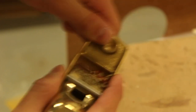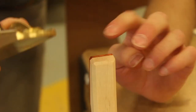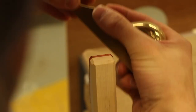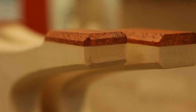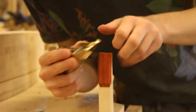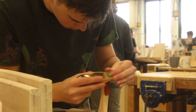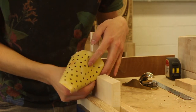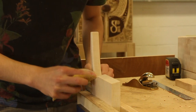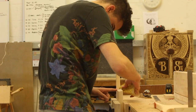In the next part, that's when I'll be joining all the rails together — but these two rails still aren't finished yet. I need to add a chamfer to all of the ends and had to be very careful to match all the chamfers. As I'm sanding, it's a really good idea to rub your fingers along the surface — your fingers are really sensitive, so you'll easily feel any bumps or discrepancies and be able to sand them away before you put the finish on. When sanding between the Paduk and the curly maple, I had to use two pieces of sandpaper because I didn't want the sawdust from the Paduk to stain the lighter wood. If you use the same piece of sandpaper, the dark wood sawdust will get into the grain of the lighter wood and start staining it.